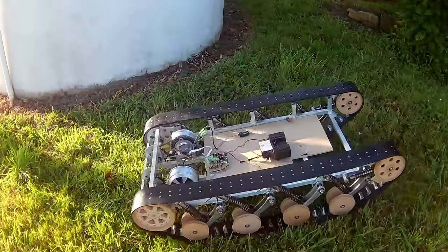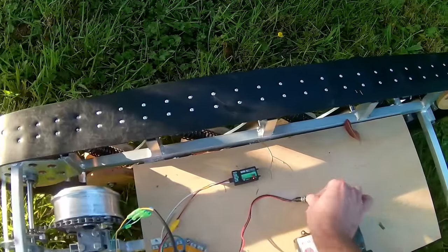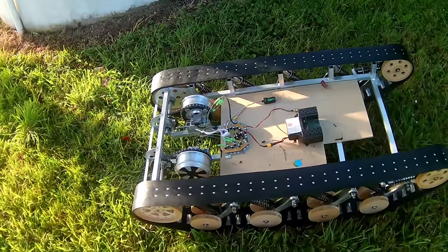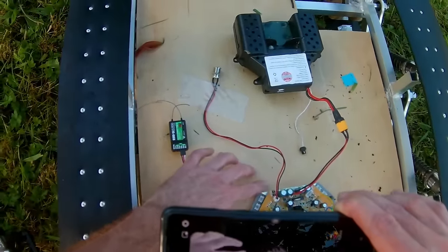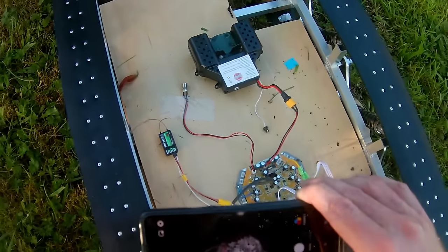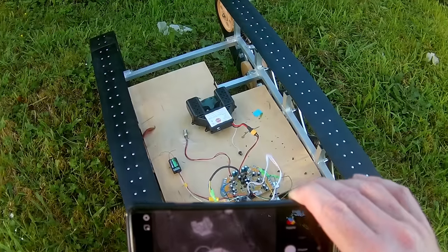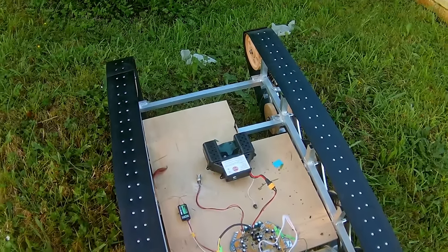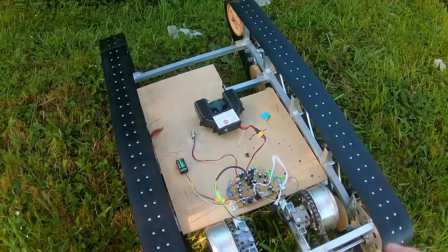Yeah, I'm not sure if the mode that I'm using is the best one. I'm using velocity mode. It's still only in the 20s though, this thing. So nothing's getting hot. I don't think it's overheating. It could be just that this hoverboard battery that I'm using is sagging and it just can't handle delivering the power that's being asked of it.